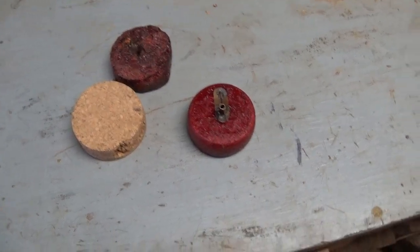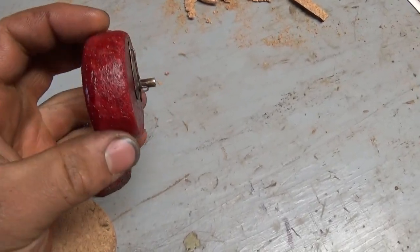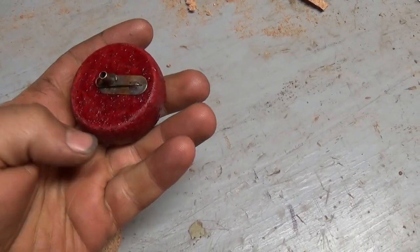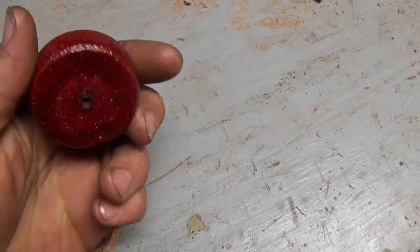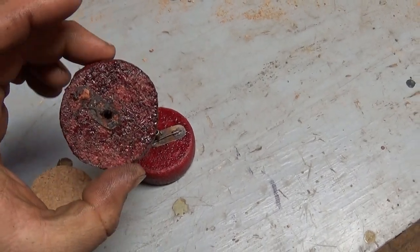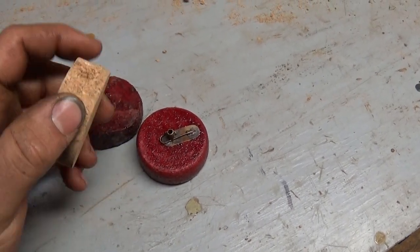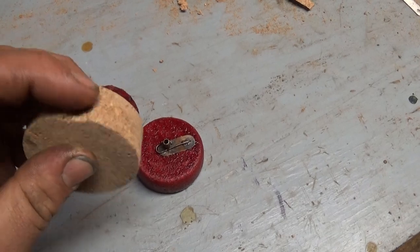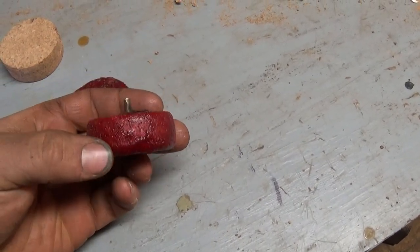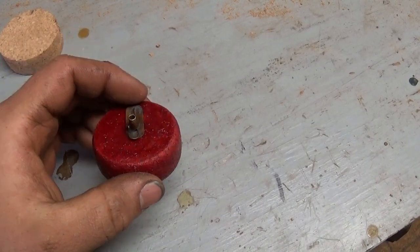It's been a few hours and this is the finished product — my new float. I've coated it with the red coat fuel tank sealer and it's almost dry. So that's it compared to what came with the mixer, or fuel feeder. This was my first attempt — I got a little carried away and the bench grinder took a bite out of the first one so I had to start again. But I've rounded the corners so hopefully that will prevent it from wedging itself in the bowl.